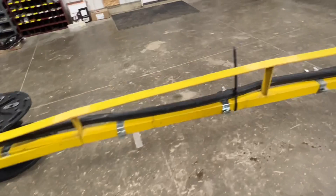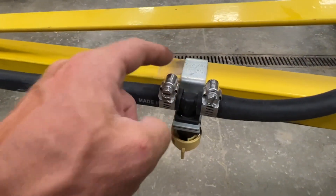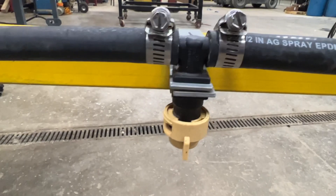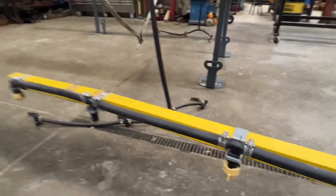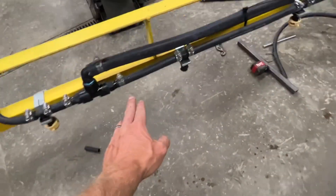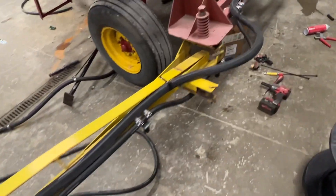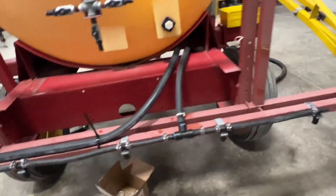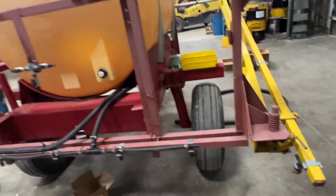Some other stuff that we did is out here on the boom. He was originally set up on 30-inch spacing, so we took more of these clips and spaced them out to where we were on 15-inch spacings. That's an old existing one, there's a new one — old and new — so now he's on 15-inch centers. We ran all new hoses along the boom so that he wouldn't have to worry about cracks or breaks.